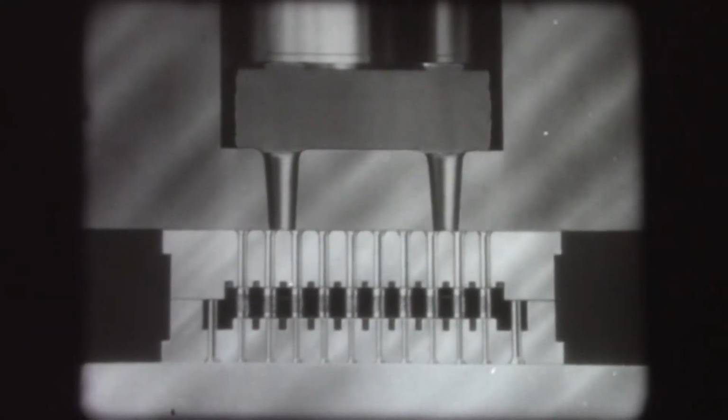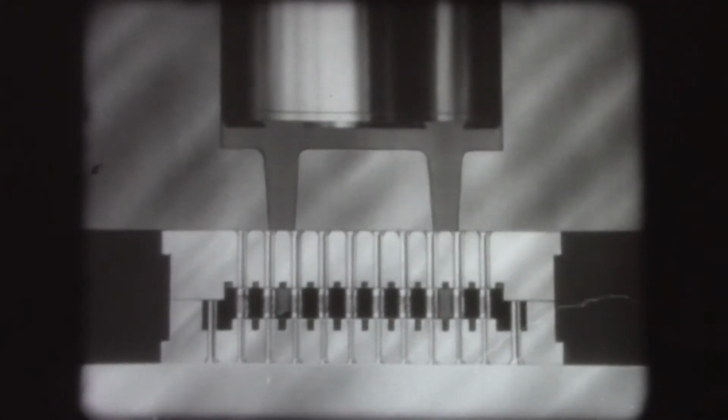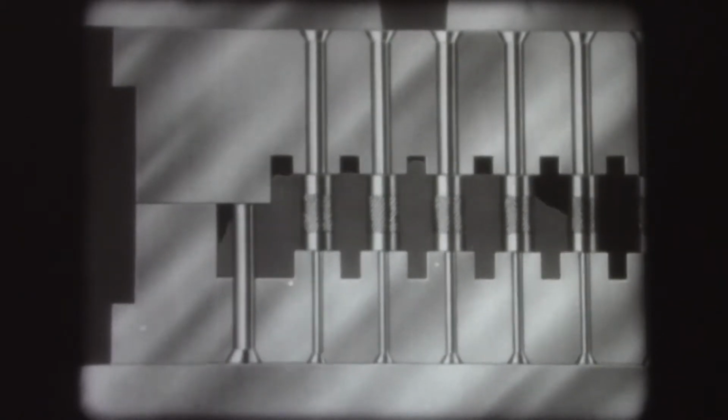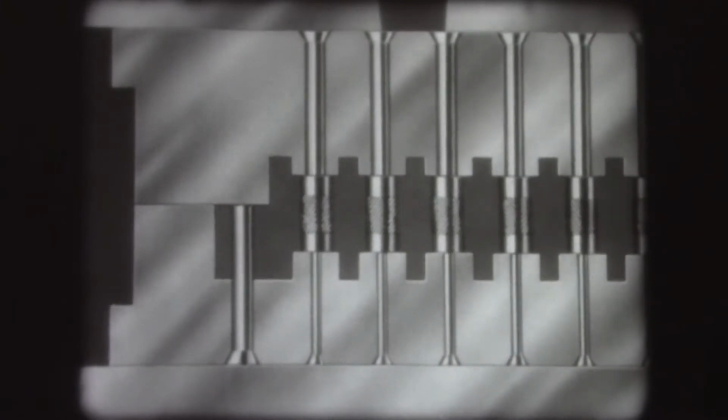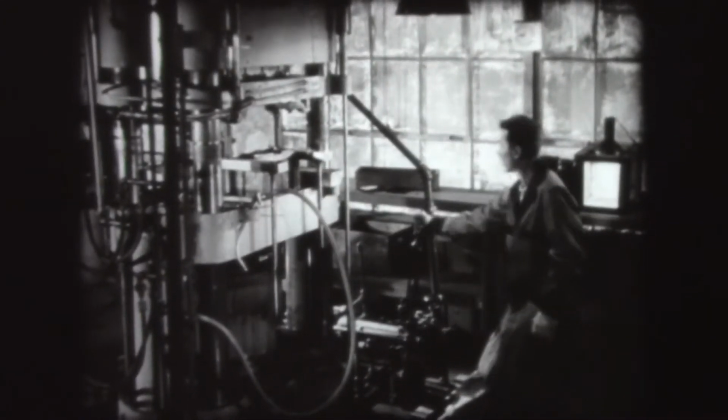Pressure and heat soften the material in the chamber, and it flows in softened form into the mold and does not distort the inserts or break delicate mold sections under the molding pressure. The pieces then fuse and harden permanently. When the curing time is up, the press is opened.